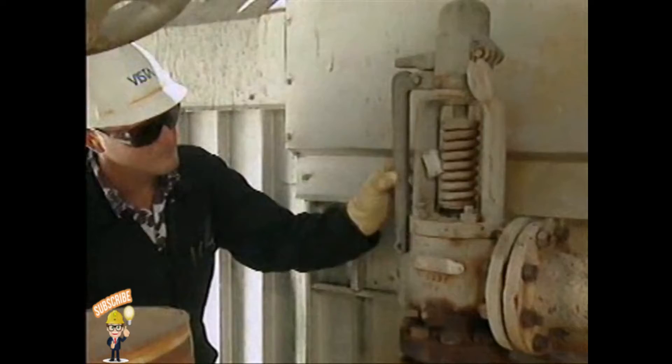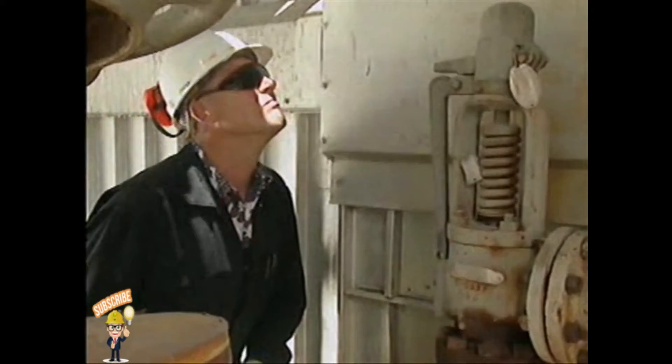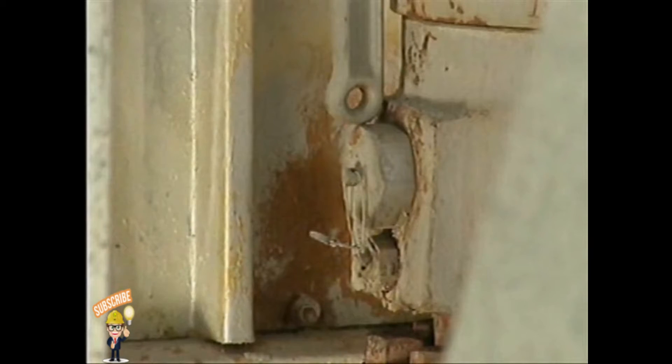For this two-ring huddling chamber safety valve, first check the lock wire on the adjusting ring pins. The lock wire is fastened in place with a metal clip as the final step in the valve reassembly procedure, so the presence of the metal clip is a sign that the adjusting rings should still be properly set for operation. If the metal clip is missing, or if the lock wire has been tampered with, the valve set points may not be correct, and you must have the valve taken to the shop to check the adjusting ring positions and, if necessary, reset them.